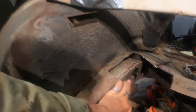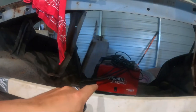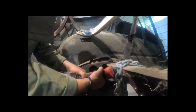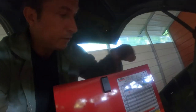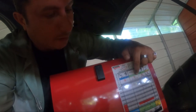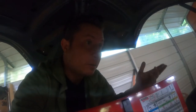We've got to clean this area up on both sides so we have nice clean metal to weld to, and then we'll set up this welder which we haven't used on the channel yet. If you're ever not sure about how to set up your welder and you're kind of new to it, I don't recommend starting with chassis work. Inside Lincoln welders, at least — which are the ones I prefer — there is always a little chart that will suggest what your settings should be for your material. We're going to work with 3/16ths steel.